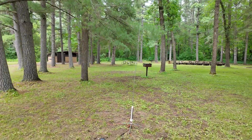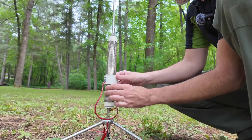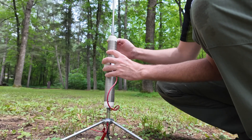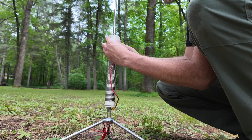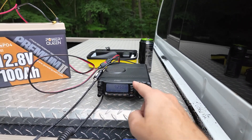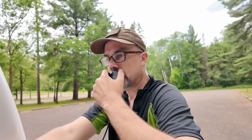That's where all the fun comes in, because this is a six-foot-tall antenna that packs up pretty small and is easy to transport. There's a little thumb screw — I release it to make it easy to move. At the top of the coil travel, I feel that first bump and then screw in the thumb screw. We've got the Power Werx battery powering the Yaesu FT-100D. I'm taking this out on its first voyage, trying to make some contacts with it.